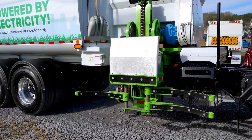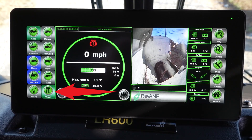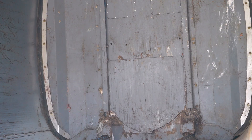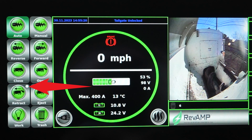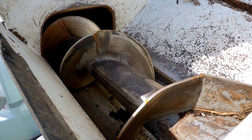If the lift arm is still not functioning, press the red collection mode button on the joystick. When collection mode is turned on, the joystick can be used to navigate the lift arm. There is an amber light on the curb side of the body near the lift that blinks when the unit is in collection mode and the lift arm is operational. If the auger still doesn't start, either manually or with dump movement of the lift arm, it could be because the ejector panel is not in the fully retracted position. Press the retract button to manually do so until there is no movement or motor working. A green circle light will be shown in the button when the panel has fully retracted. If the circle is white, it is not fully retracted and you will need to hold the retract button until it turns green. Afterward, you should be able to use the auger normally.